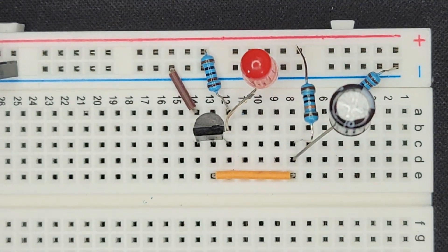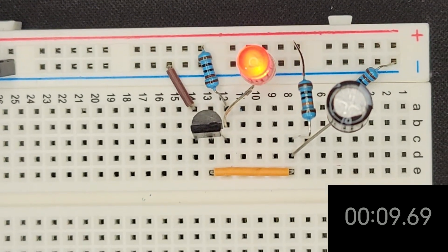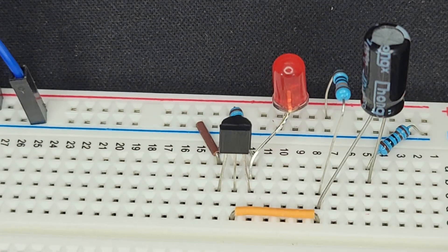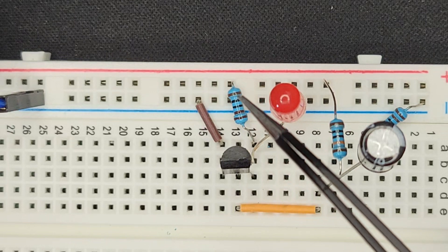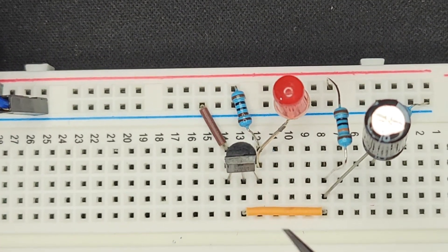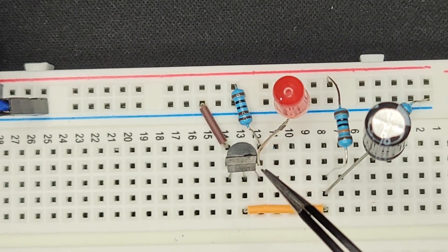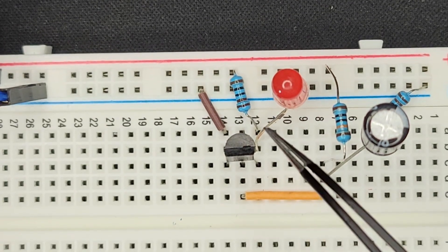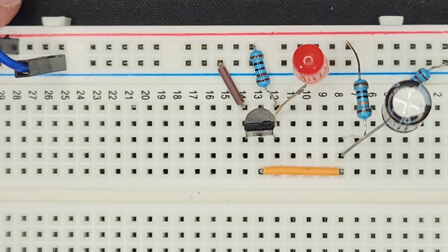I think this should work. Let's turn it on and see what happens. Power's on right now — we can see the LED went out. What happened is before the base could charge, the resistor had no other path to ground. It can't go through the transistor because the base isn't turned on yet, because the capacitor is not yet charged enough. So the power is forced to go through the LED. This is the reverse of what we want — the LED was on by default then turned off. We need to flip it, so we need to add a small inverter.